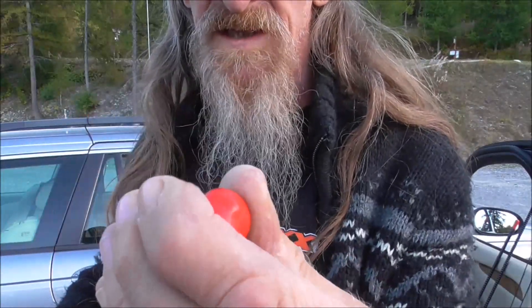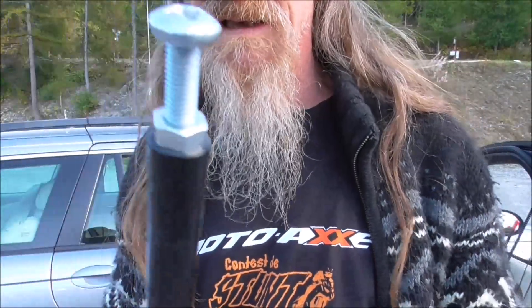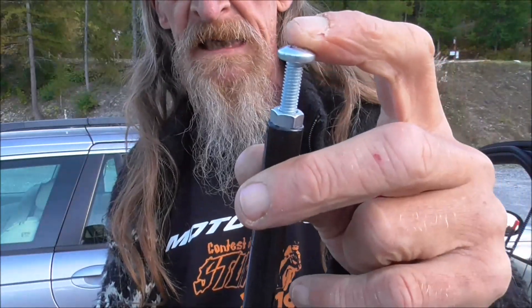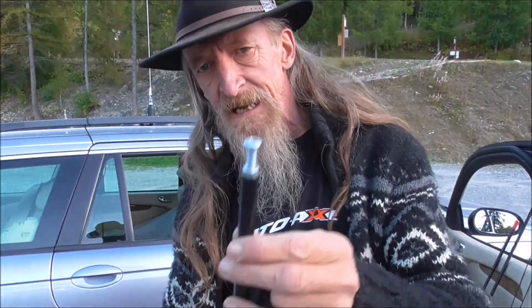These fire sticks actually come with an adjustable screw on the top. The two-foot fire stick — the first surprise I got was when I pulled the four-foot one out and the plastic came off, and I thought: wow, you can actually adjust it. That's about halfway, and it's tuned in perfectly for 26.3. The two-foot fire stick tuned in better for the longer wavelengths, the three-foot was kind of in the middle, and the four-foot was for the shorter wavelengths. I don't know why, but that's the way it turned out.